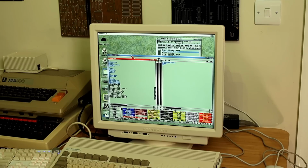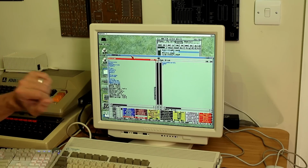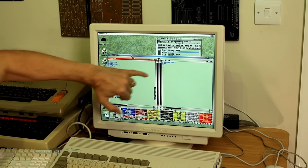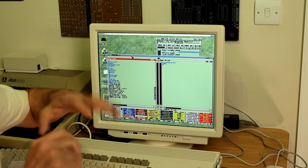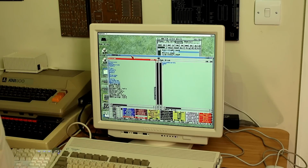The only thing that sometimes gives it away, and I think this might actually be because we've not got the breakout board in there yet, is that the wiring inside is still a little bit noisy. I think you can see it here. So that's the reason for the breakout board. The breakout board will make very short cables to connect from board to board, and then it'll be on a board, so it'll be much better signals.